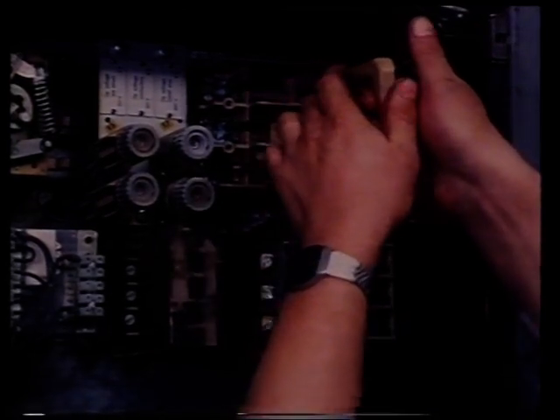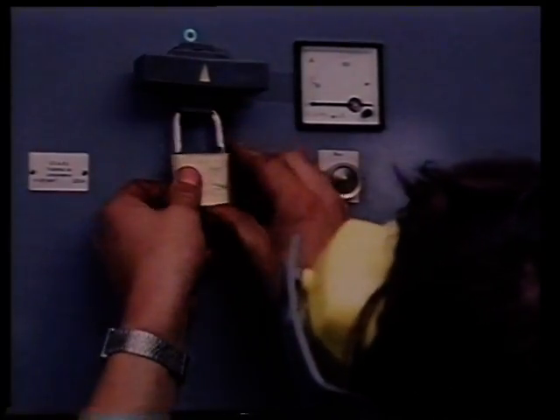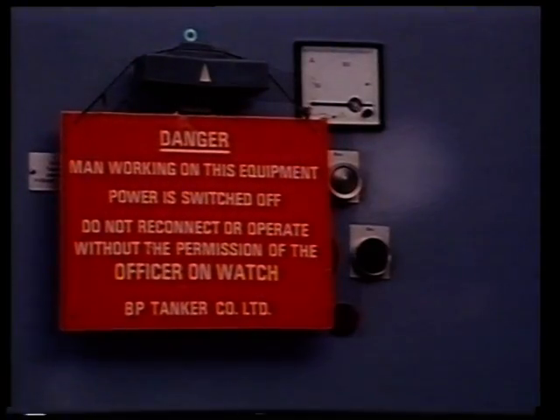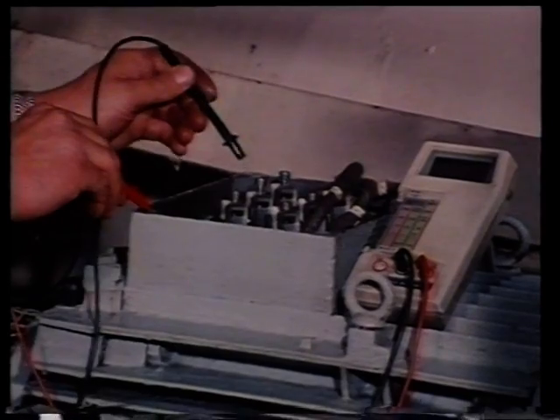Now we must emphasize electrical safety. The golden rule is: before any work is done on an electrical installation, first isolate the circuit by removing the supply fuses or locking the circuit breaker in the open position, so that the circuit cannot be energized accidentally. Then post a warning sign to alert others that the circuit is being worked on. Then prove the circuit dead with a voltmeter or an approved line tester. A switchboard can never be considered dead unless all AC generators connected to it are stopped, locked off and all other supplies are disconnected. These points can never be emphasized strongly enough.